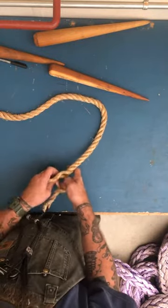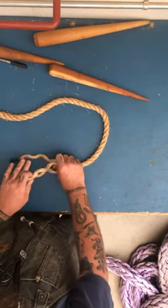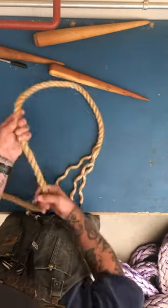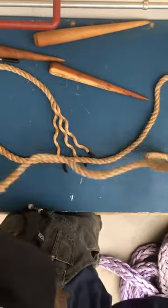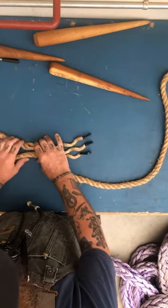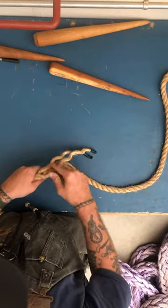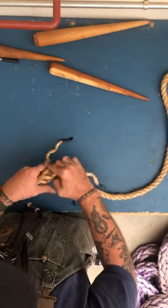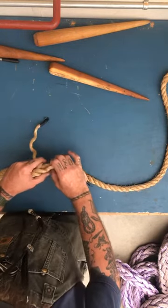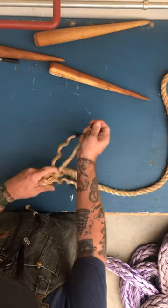I'm just going to wing it today on how much I lay back. You don't need that much — people tend to do a lot. Remember, this is natural fiber so you only need three tucks. I'll switch it around on my right-lay line. We'll just make a small eye. When I take this three-strand, I like to lay the two outside strands on the outside and the first one down the center. I'm just going to lift this up and bring my first one against the lay.